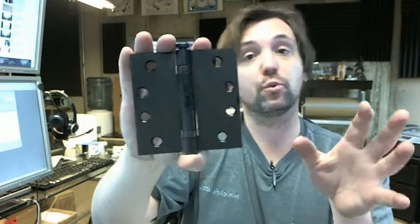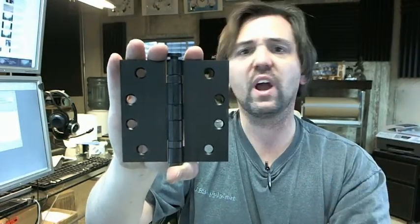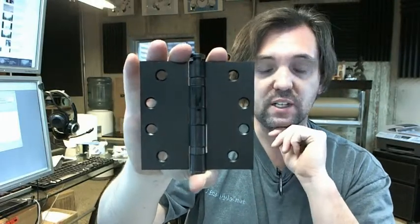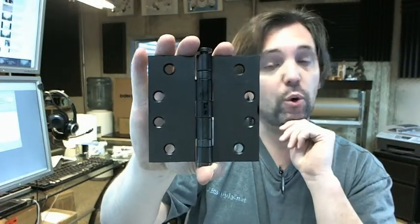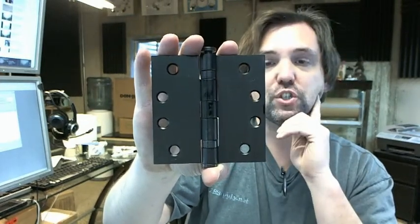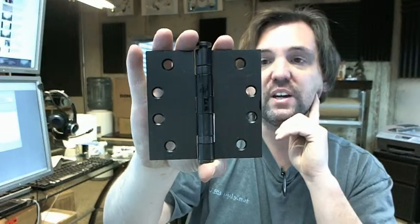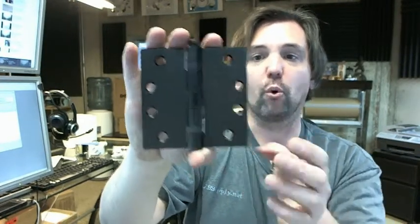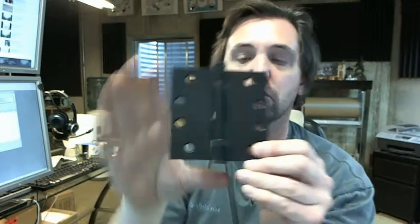This is appropriate for an inch and three quarter door — if it was a wood door and wood frame, like the front door of a home, 4x4 ball bearing hinges are a real good idea for that. For thinner doors, you should go to a three and a half inch hinge if you've got an inch and three eighths door, but for an inch and three quarter door, 4 inches is a good size.